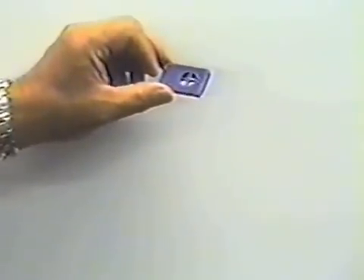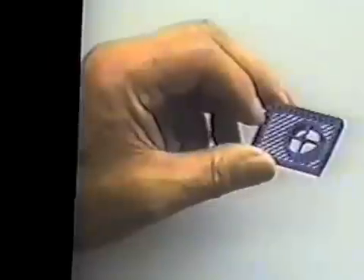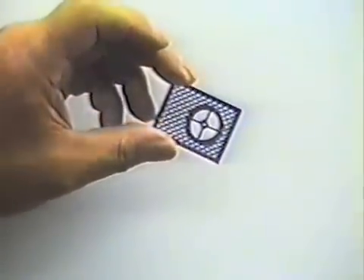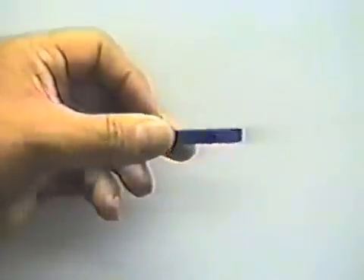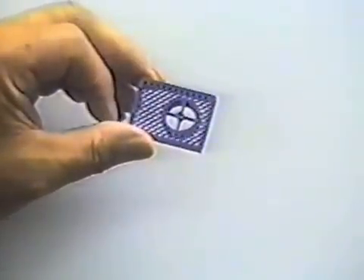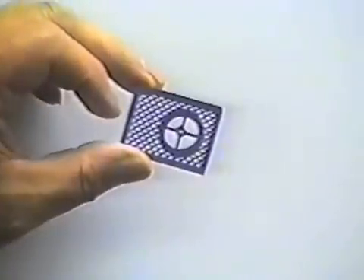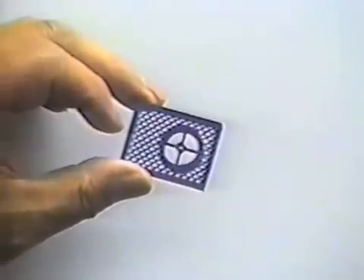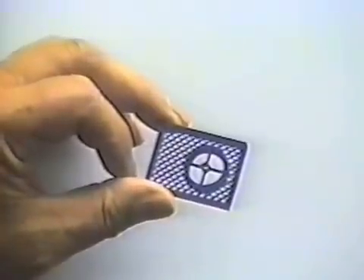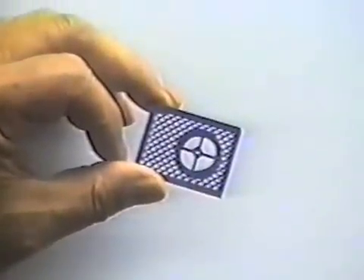The material is ideal for investment casting. We have proven that we can take this material, coat it with a ceramic, melt it out, and it leaves no residue or impurities, making it ideal for producing a functional part. Also, the machine has the capability of producing either the positive or the negative. If you have a situation where you want to mold something — in an injection molding machine, for example — you could make the negative of it, which would produce the tool that you could use to injection mold the parts in.